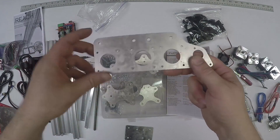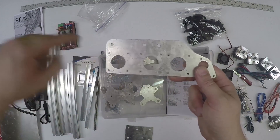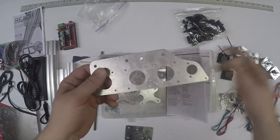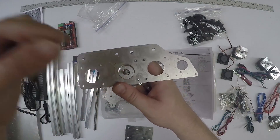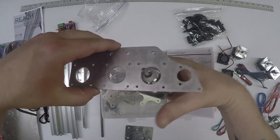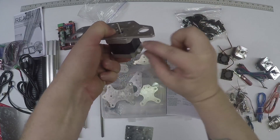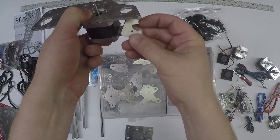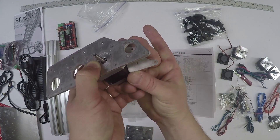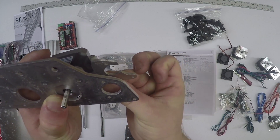You have a YZE plate - I call it that because this is the Y motor that moves the table back and forth, this is the Z motor that bolts on and moves the Z lead screw, and this is the extruder motor that drives the large extruder gear and the small one and the whole extruder. This is the extruder support plate and they kind of go together so that the holes line up - kind of hard to show on camera but you get the idea.